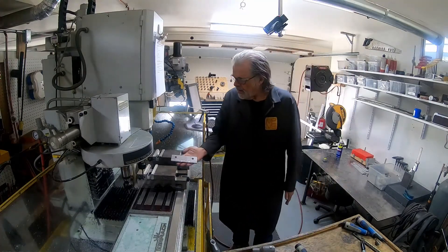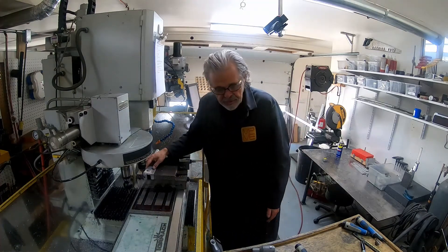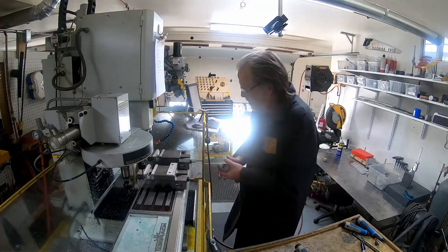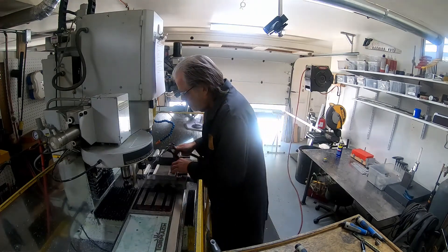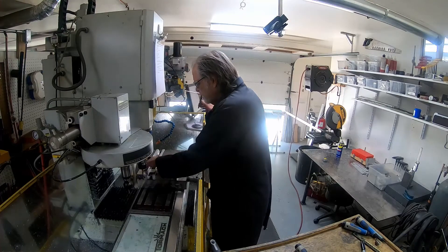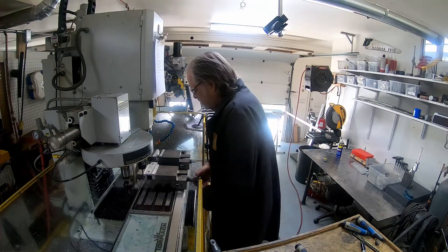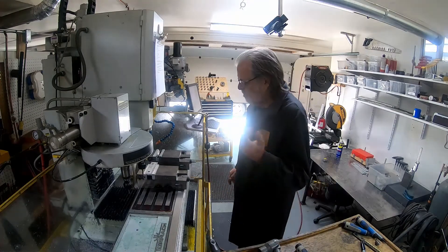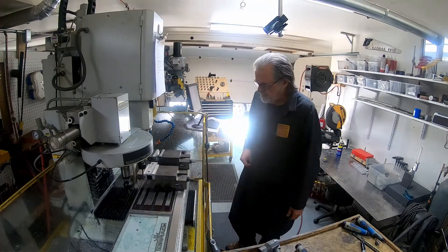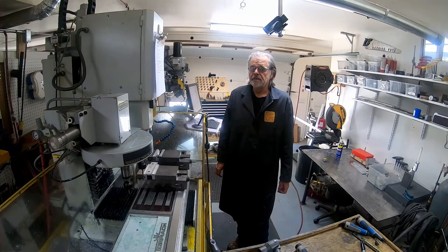I'm using a known trusted tooling plate and a known trusted tool path. The vast majority of this production run is going to be designs that I've used before, tool paths that I've used before, pretty much without modification. Occasionally, as the project goes along, I'll optimize the tool path, maybe reduce cycle time, but the Inqualas that I'm making now are almost identical to the previous run.